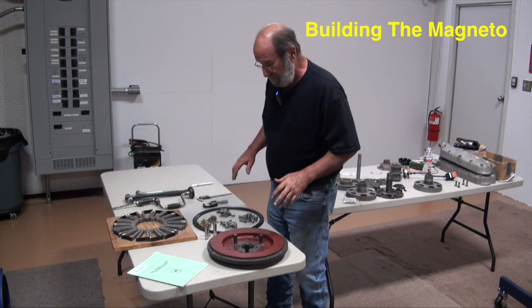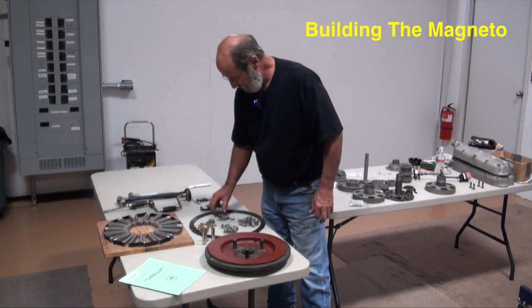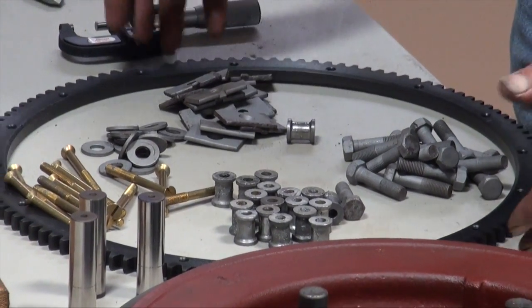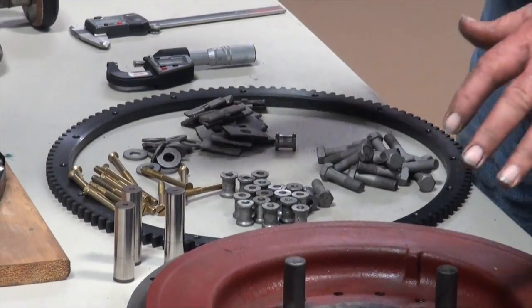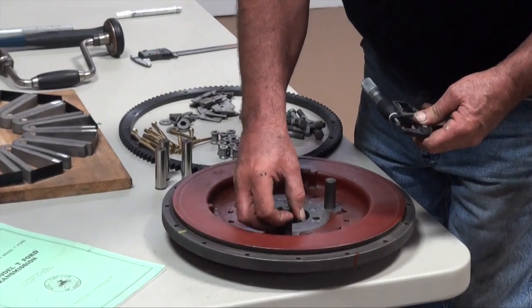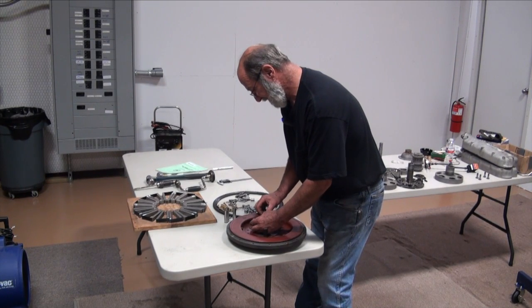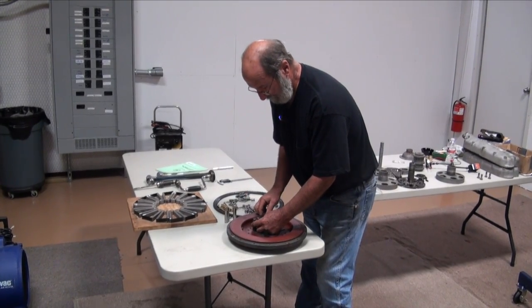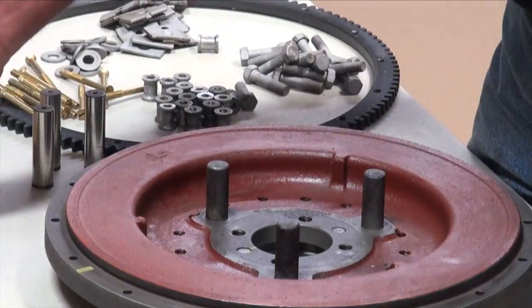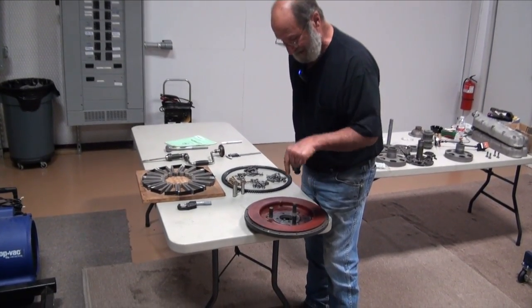The components to build up the magneto are obviously the flywheel, the recharged magnets, the spools to stand off, the clamps, washers, bolts to hold the magnets in place. We're replacing the brass screws that go down through it, and we've got a new starter ring gear. This makes up the assembly of the magnets on the flywheel. One thing I want to check is these pins — I know they need to be replaced because they're pitted and rusty. When I measure the pin, I get way undersized on the wear surface. So I'm going to replace the pins; they can simply be driven out — they don't need to be pressed out — and they go from this side down.